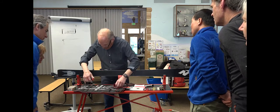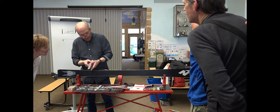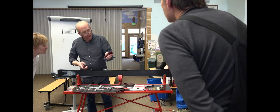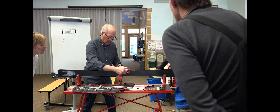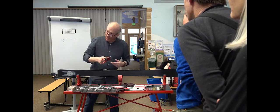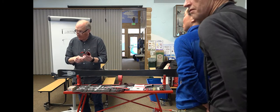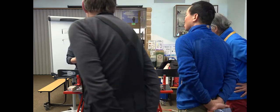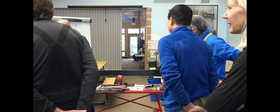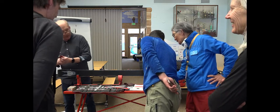then I like to go with what's called a second cut file. Put on like this, kind of a little angle, like this, and you'll feel it. You can move it a little bit if you want. You'll feel where it cuts. Does it matter if that file is at an angle? It has to be at somewhat of an angle to cut, anywhere around 45 degrees, 35 degrees. But if it's like this, or this, or this, it's still going to cut, because the teeth are cutting. What determines that it's backwards is the part that's been milled into here. So that's milled into there.